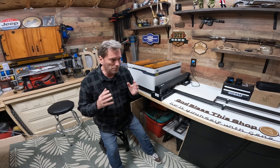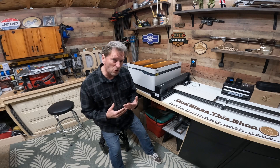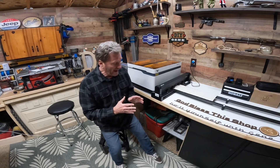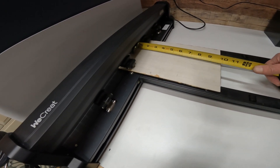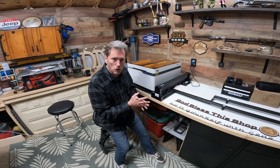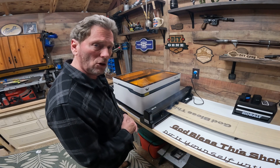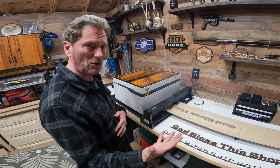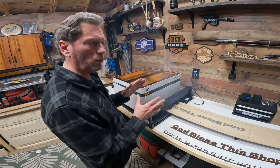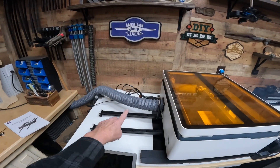So much of this is just playing with it. You're not going to straight out of the box make it work just right — there's still going to be a learning curve. But it has got such incredible potential. One of the things you're going to want to make sure is that whatever length material you're going to be cutting or engraving, add about 10 inches to the end length, because that's what's going to need to still be back here to catch the rollers as it's finishing. Now you can see I'm getting a little bit of smoke coming out of here, so that's something you're going to have to deal with. It's not a big deal for me because I'm outside in my shop, but it's probably not that healthy either — it's burning plywood. So I've got to look at doing something else that can help pull some of that smoke out more than through just the hose here.